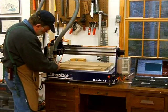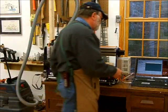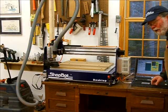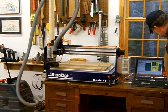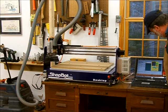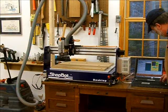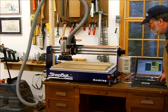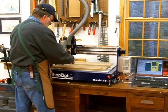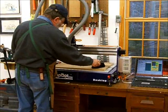For the vacuum dust collection I've got to raise this a little bit. They make this really easy — you type the letter K, a little keyboard comes up, and then you can use page up to raise it, your right key to bring it over, and the up key to bring it back in the Y direction. This little dust boot is held on by magnets. It's really kind of cool.